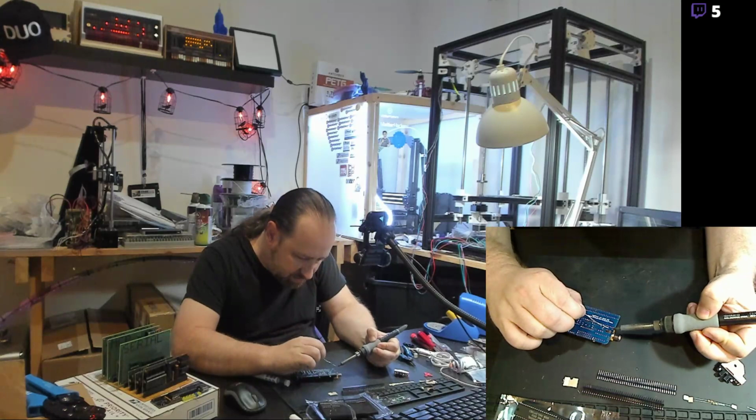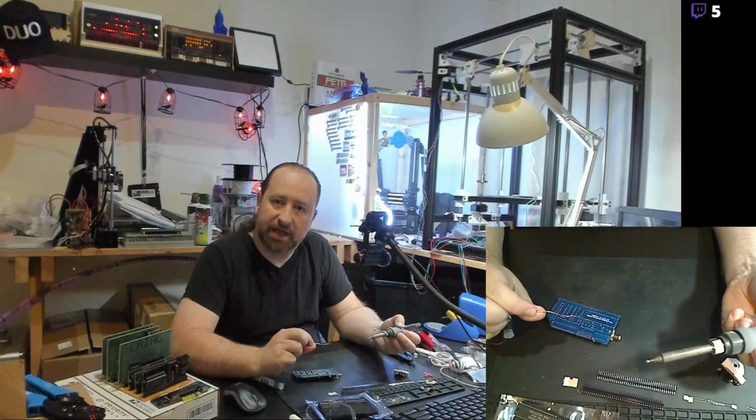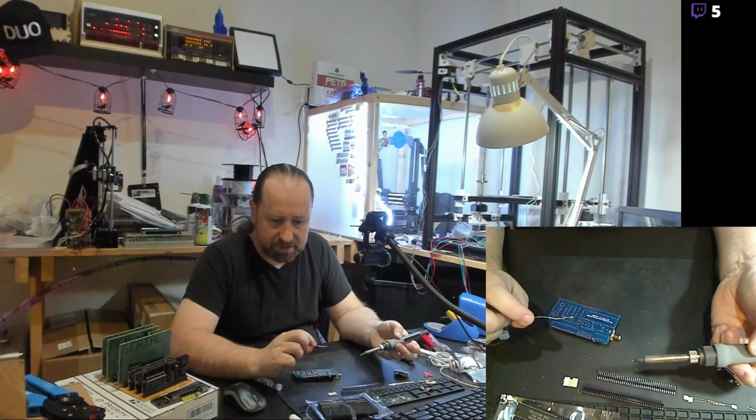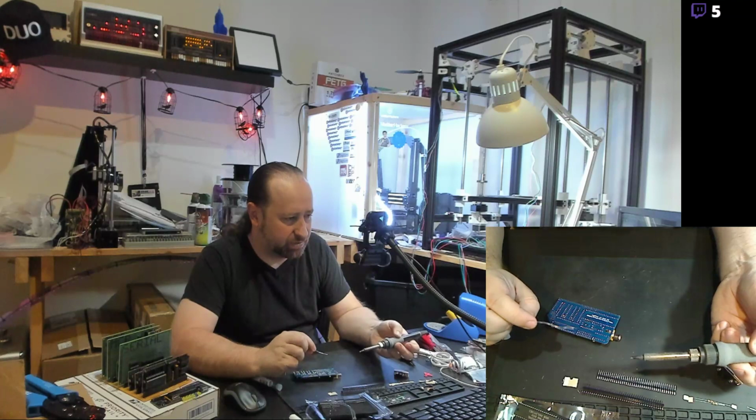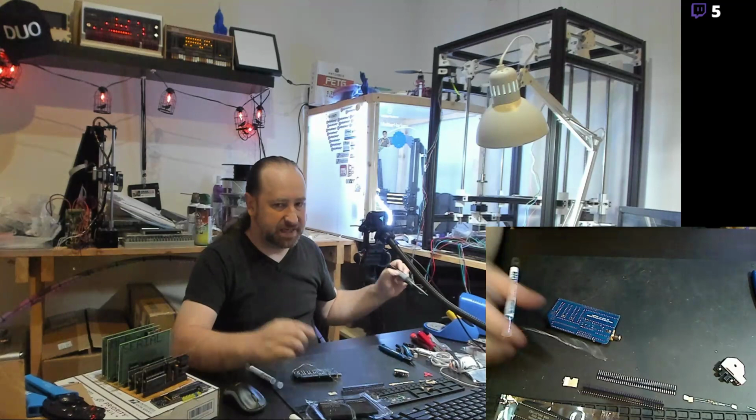I wanted to replace my end stops on my Axiom to optical. Yeah, you probably could. The hardest thing with replacing your end stops is actually, in most cases, you'll have to design new pieces and print out new pieces that either sit where the old bumper, whatever bumper would hit the switch, and extend out a little flag for the optical sensor.